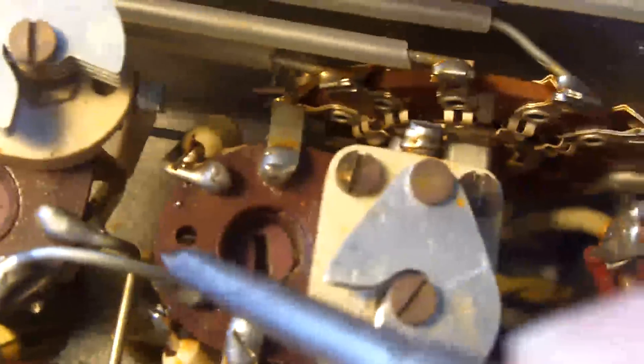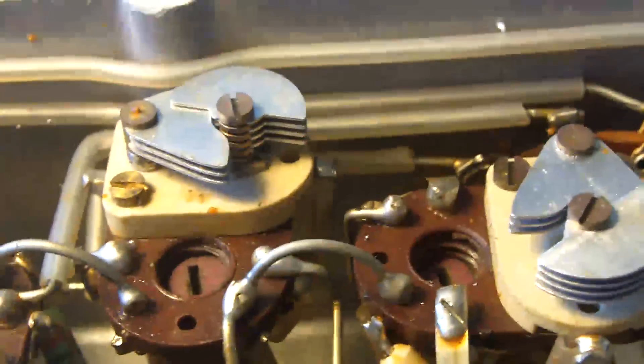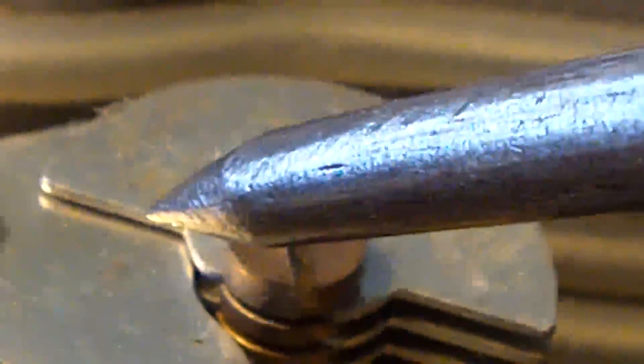With a little nudge it'll come off and I'll get rid of that. There are one or two places where there are little splatters of solder. You might say it's not very significant, but when you look at the spacing of these capacitors — it has a very, very tiny space there. The gaps between the fixed and moving plates are very, very tiny. So that little bit of solder, should it come loose, could it get in there? You saw how that nut was misplaced — interesting stuff.